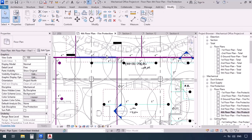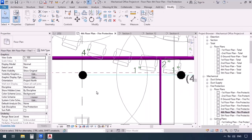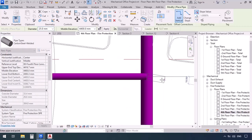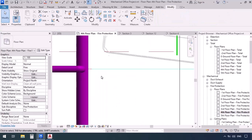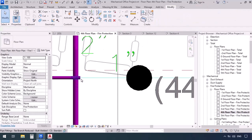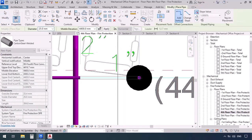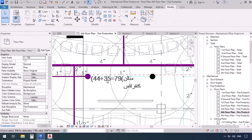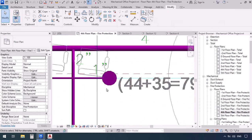Let's go back to the plan right over here. First, I'm going to get the pipe command PI, then with elevation 4400 and diameter 25, I'm going to go here and click. The next click would be over here — let's go to the edge of the pipe so that they connect. Now I'm going to click on the plus sign of the elbow to convert it to a T, then right-click on the T and draw pipe. Then go to the next sprinkler. From the sprinkler, I'm going to have to convert the elbow to a T to connect it to this one.